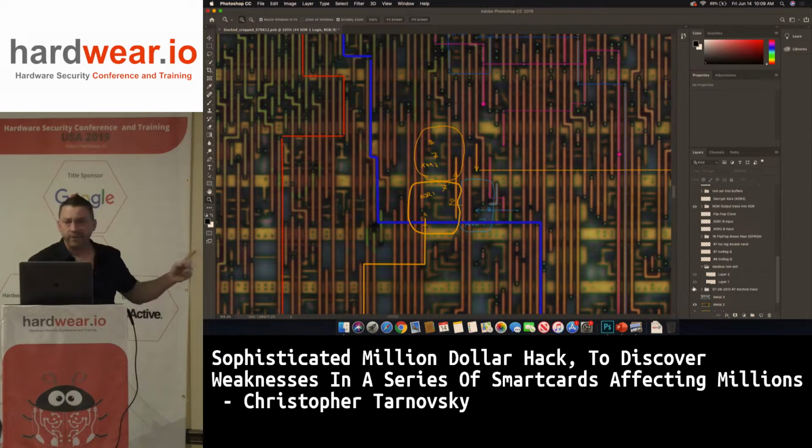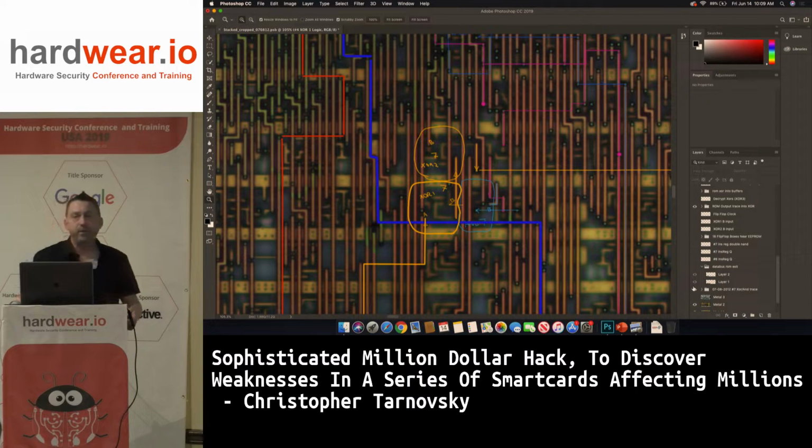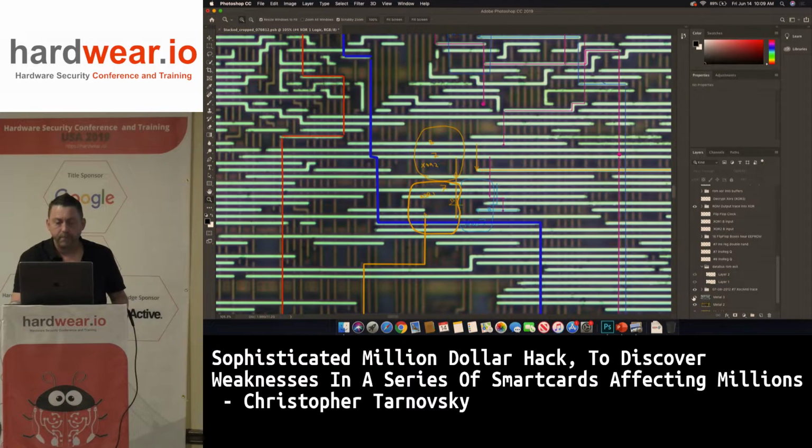This is not good enough for a SEM image, though. These pictures are good optical, but for a SEM, these are not. Everything needs to be white. So the vias, you can see the vias in this picture that are going up to another layer. You can see the wires. These wires wouldn't show up. They wouldn't light up in a FIB or a SEM. So you can see metal 3 turns on. Metal 3, though, metal 3 is white. So metal 3, I polished perfectly till it's white.